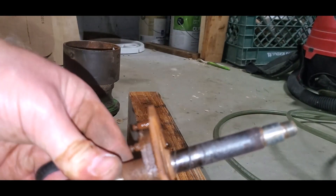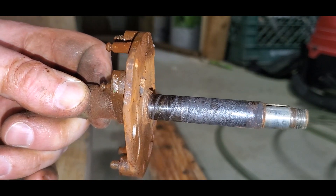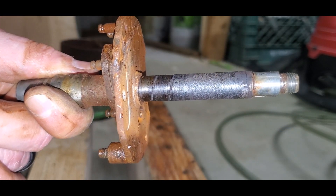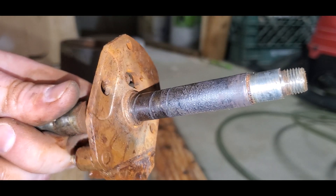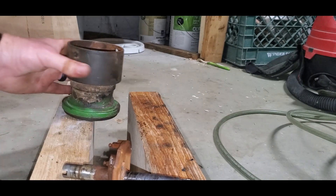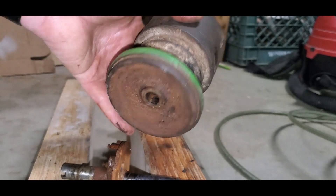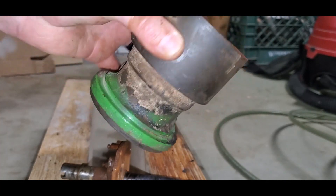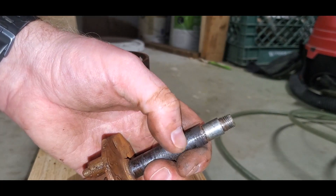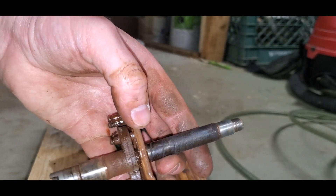There it is. Let's zoom in on that shaft. I think it looks like that is just galled-up metal — like it ran out of lubrication and the metal just got hot or something. There's the inside of that. The bushing is still there. Now we'll just clean everything up, get this polished down, and hopefully get it put back in there so it rides nice and smooth.